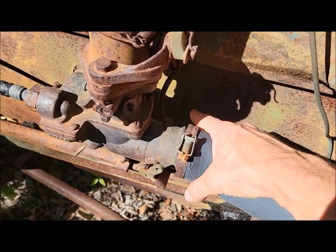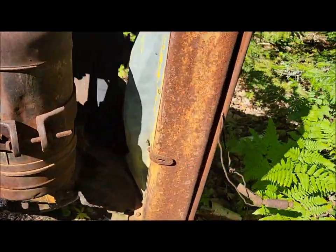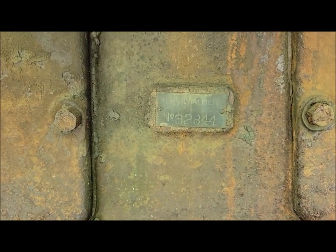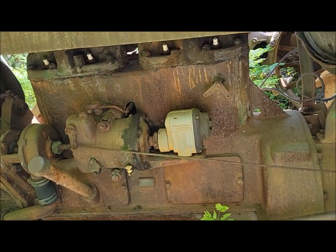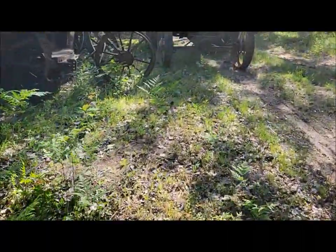So this is a dash 15, if you can see that in the sun as well, where my 27 has a dash 16, and this one, the actual serial number is a 32,000 number. So this one's actually a little bit older engine, but they swapped parts, because this doesn't have 27 heads on it either. This is 28 or after heads. So you can mix and match some things. You can't mix and match everything.